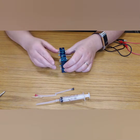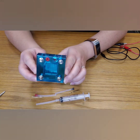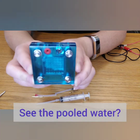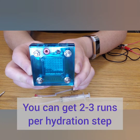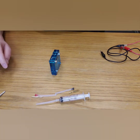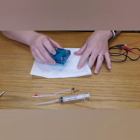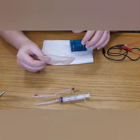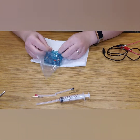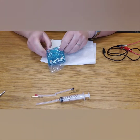Take your gold pins out and set them aside — be careful they don't roll away. You can see towards the bottom where the water has pooled in the spent fuel cell. This means you don't need to hydrate your cell each and every time you run it; for model car purposes you could probably get two to three runs per hydration. If you have any excess moisture on the outside, dab it dry with a paper towel or cloth, then seal it in an airtight container like a zip-lock bag. You could even wrap it with cling wrap nice and tight — whatever you use, make sure no air gets inside.